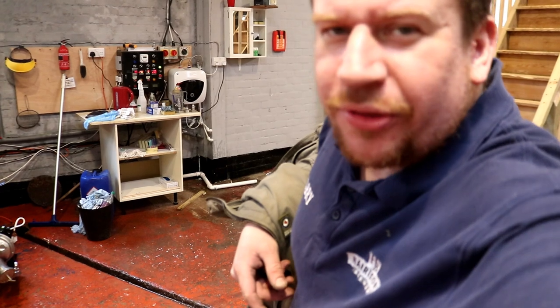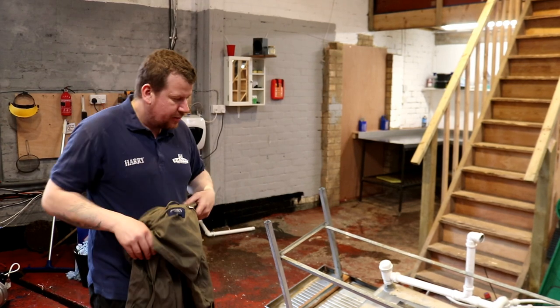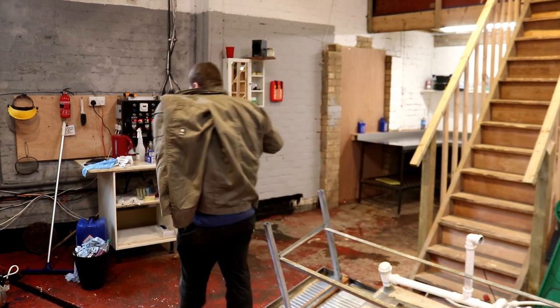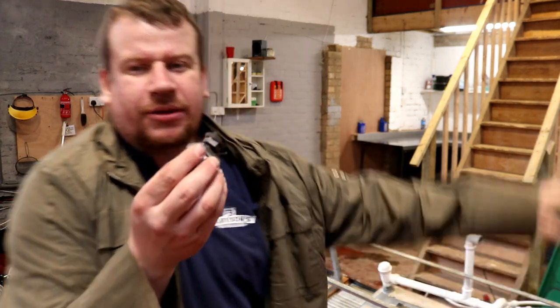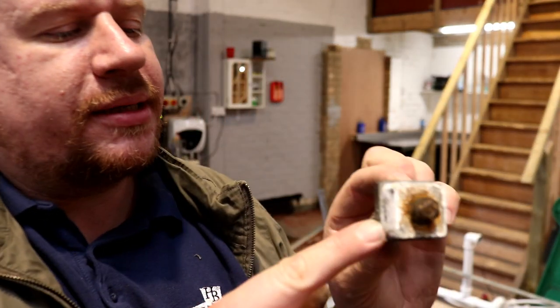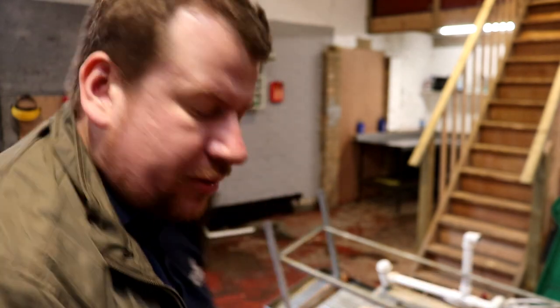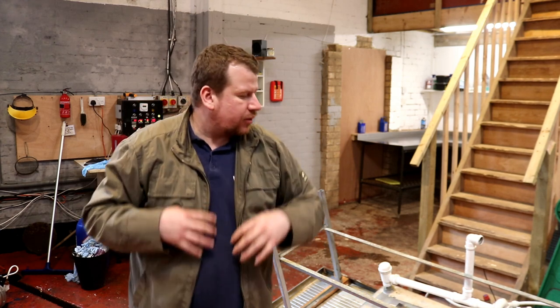Yes, I know what you're thinking and I'm thinking it too. It looks drastic now because the sink's gone. But we had a problem with that sink. It had these legs. Taken them out, managed to get them to come out. So the aluminium inserts was steel threaded bar through the middle and some type of leg on the end. So of course they're gonna seize up, and they have. And people have just snapped the bolts off. Dissimilar metals, young man.